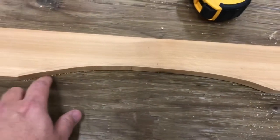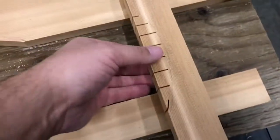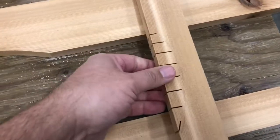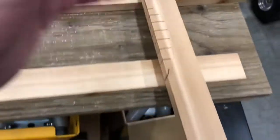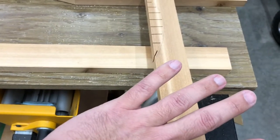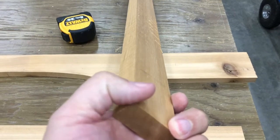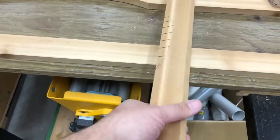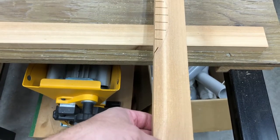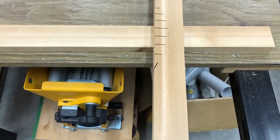I'm cutting out a radius here so that it can fit on the top of the unit, and then this is a cutout for where the water bottle holder and some other stuff is in this area, so I gotta cut it out. It's basically gonna just slide down over top of the face on the outsides. This is gonna have to be routed to a very wide radius — probably about three-quarter inch. Anyways, I got the stuff milled down, went downstairs and did a story stick on the treadmill just to get a sense of what I need, and then I'll slowly work things down with the bandsaw, the sanders, and all that to make it all purdy.